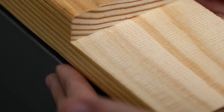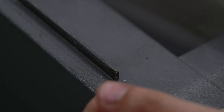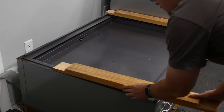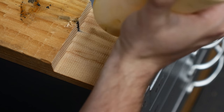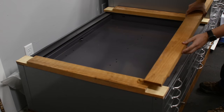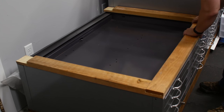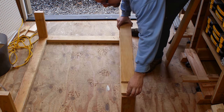My filing cabinets have grooves designed to lock other cabinets into place so they don't shift. I needed to account for these grooves on the bottom frame, so I took some measurements and cut a test slot in some scrap wood. I was just a tiny bit off, so I adjusted the fence on my table saw and got a groove that was perfect. With the grooves cut, I was ready to glue up the bottom frame — I decided to glue the frame right on the cabinet to ensure it would fit with the grooves.